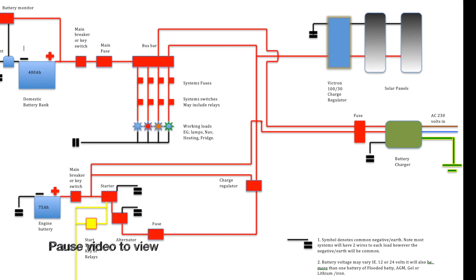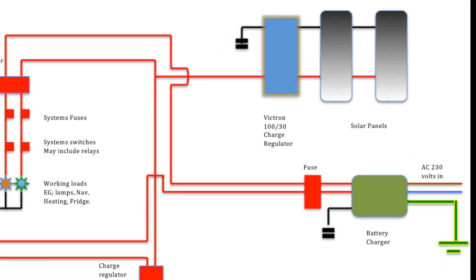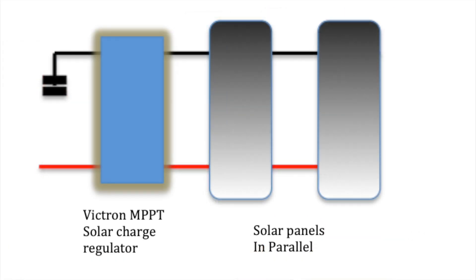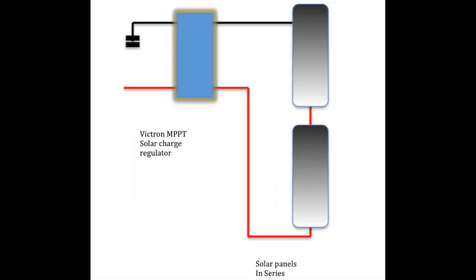In order for Cindy and any other crew to understand how our systems work, I did this schematic. You'll notice the solar panels are arrayed in parallel. There are two ways to fit solar panels — you can fit them in parallel or series. After a number of experiments casting shadows, we found that parallel was best for us.